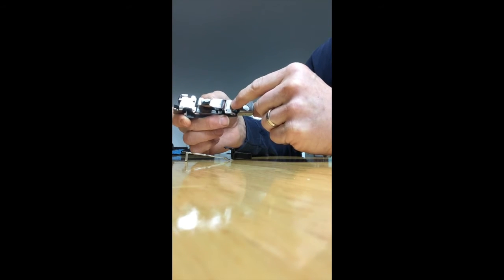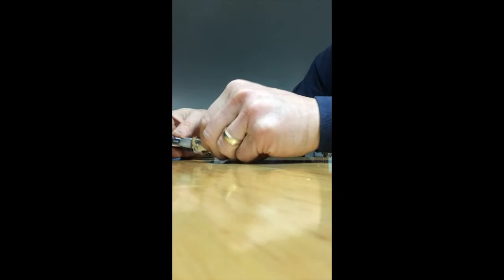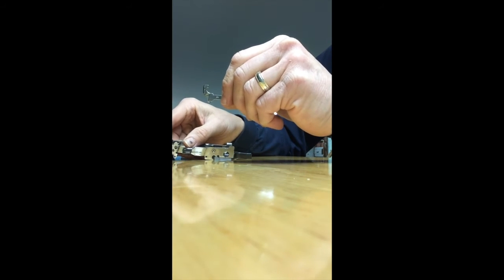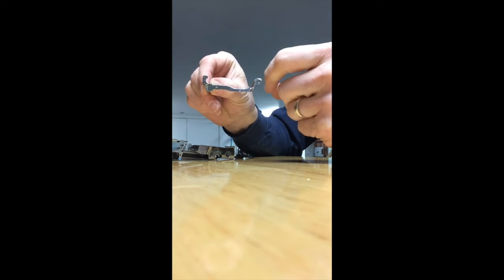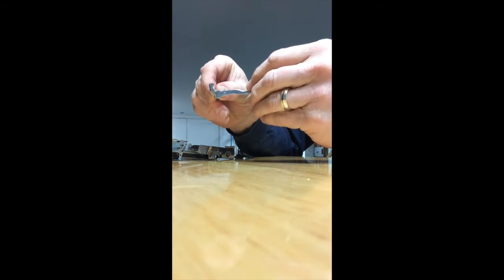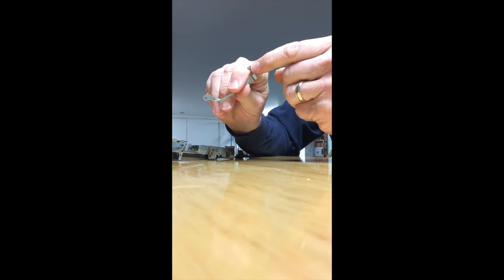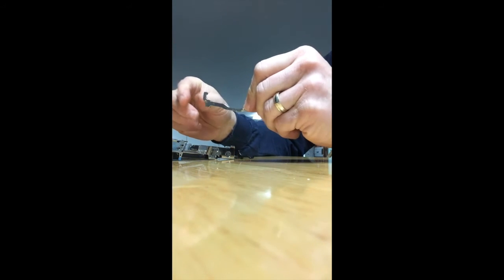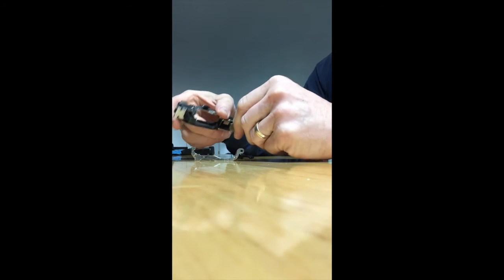There's friction here, and there's friction here. Why? Well, here's the trigger bar. Take a look at the trigger bar. This is as you would face the trigger bar, so the friction is going to be right along this edge, and on that one point that's extending to the back. These areas can be polished. They can be polished to a mirror polish. You can polish them by hand.